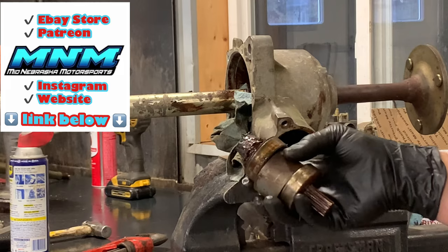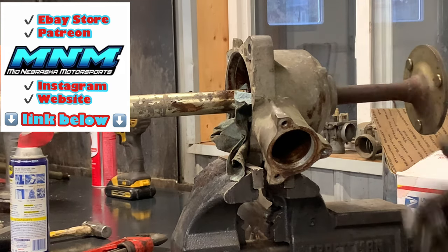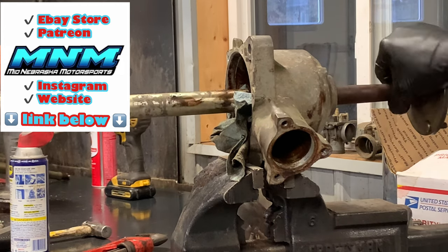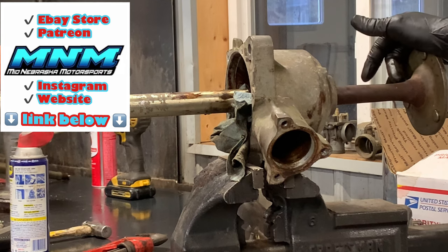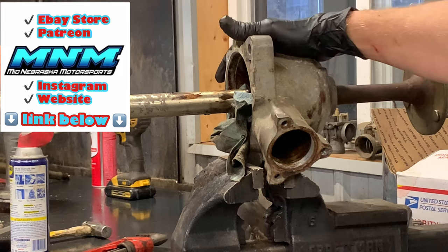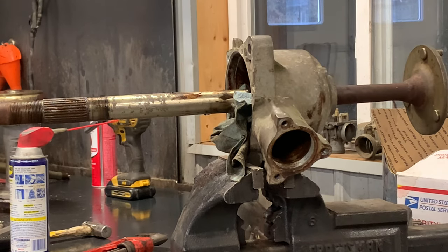This gear is clearly going to go in the trash unless somebody wants it — I can ship it to you. The other problem is on this Badger somebody used a bit of a weld on here, and I'm either going to have to cut this hub off or just use this complete housing, axle, and pinion gear all as one unit and sell it that way. Not ideal, but that's the situation we're in right now.